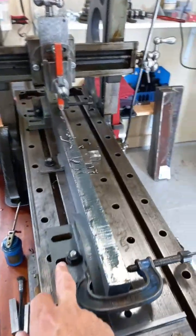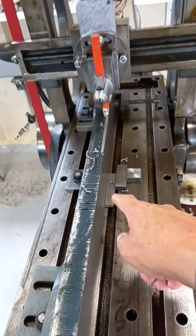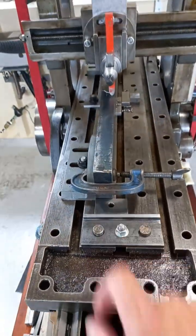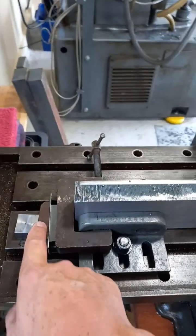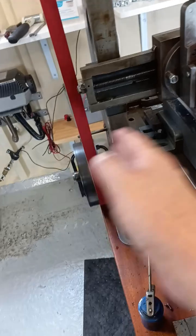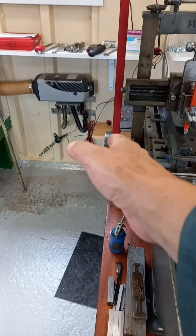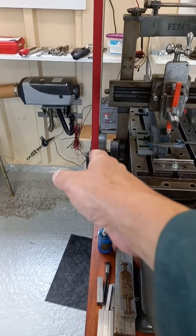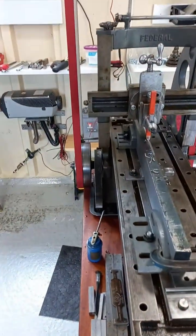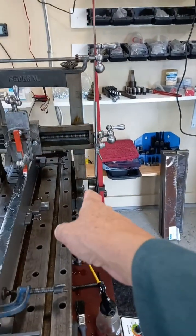You can see I've used a couple of angle plates here. I've used a stop and wedge — my stop at the front with the dowels, and around the back we've got the trusty wedge and square dowel. I made one or two adjustments to the belt positions as well. These mechanisms have worn and what was happening was it wasn't running all the way across onto the loose pulley — but now it is, so it's free.